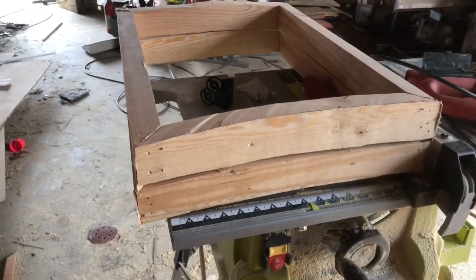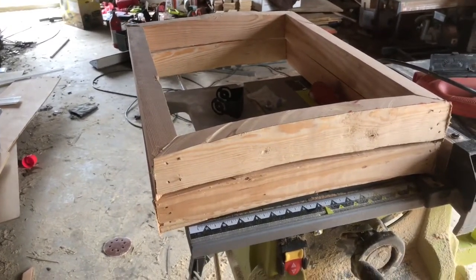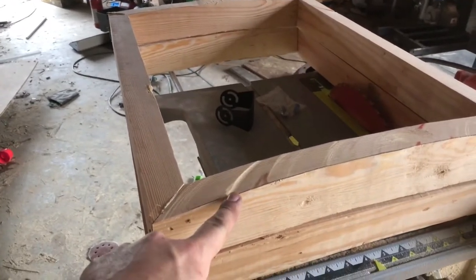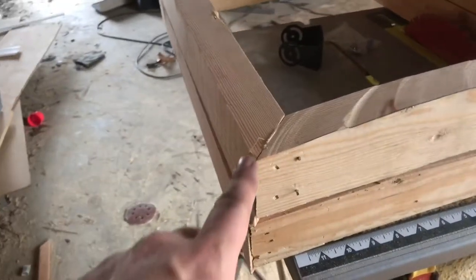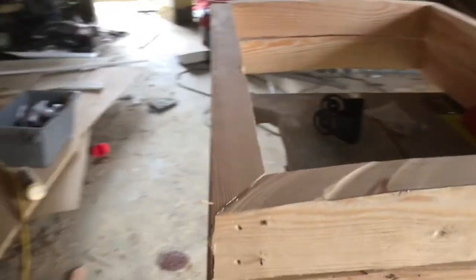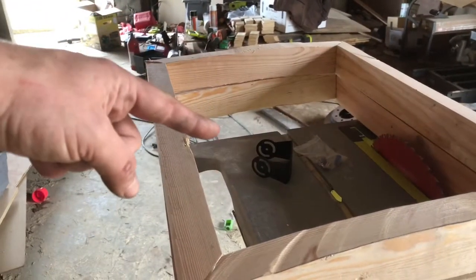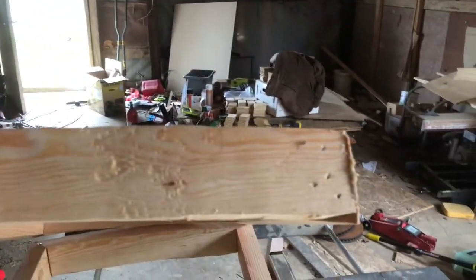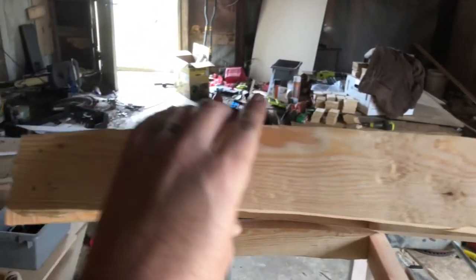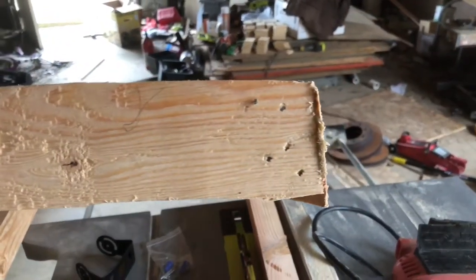So what I have made here is two boxes. These are very unique and kind of difficult to assemble — if you don't have the skills in carpentry, which you can see I don't quite have. Get a friend who's good with woodworking to make something like this. Basically what I did here was cut some two-by-fours at 45-degree angles, the proper inside diameter that I wanted for my opening for my skylight. Then I cut and traced the proper curvature of the bus roof. There's some bad overlap here, but it's actually fine — I'm just going to shim things where I need to when I install the roof paneling.